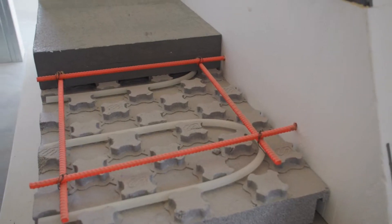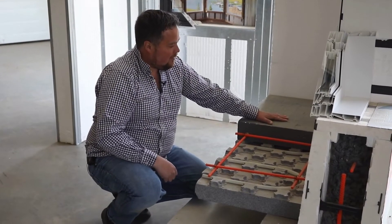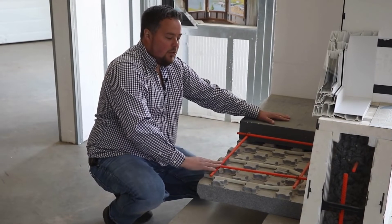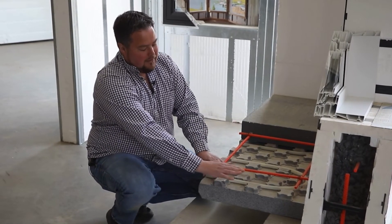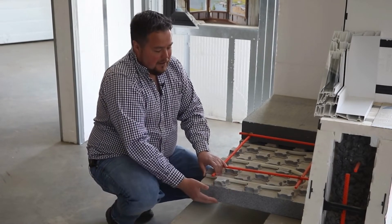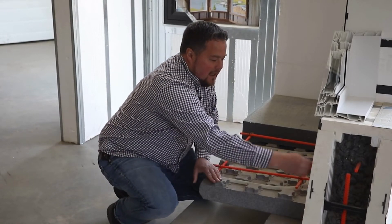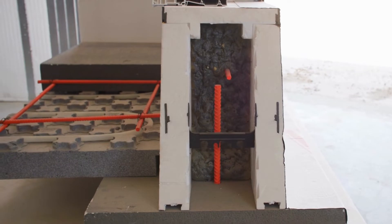Down here at the floor — the concrete floor in your basement. One thing that we also do that's not common practice is we put rebar in our basement concrete floors. Below that we have styrofoam, generally about four inches thick, and it's continuous over the footing, connecting to the ICF, so we have that continuous blanket of insulation.